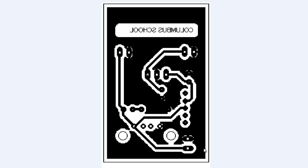In this case, we're going to do it in a very traditional way because we are building a small circuit. So all these holes are already open, and you can put all the elements there. When you have the elements, you will start soldering each element to this part. You have to make sure that the soldering does not touch another part because that will be a short circuit. So make sure that when you solder, it is a very small amount of solder.